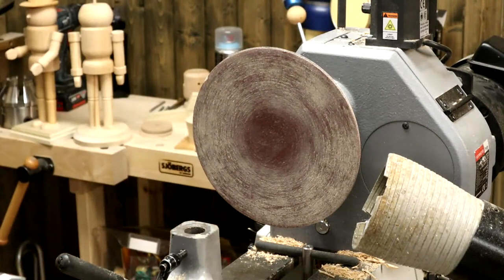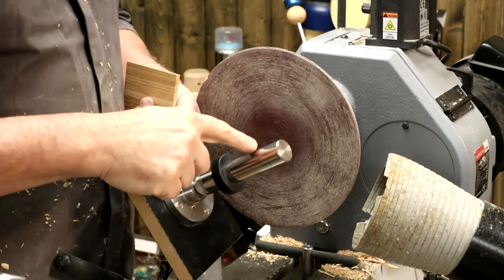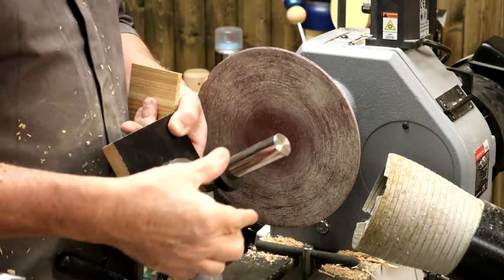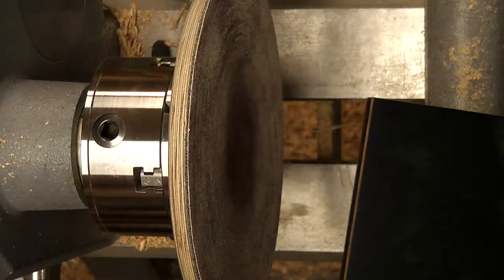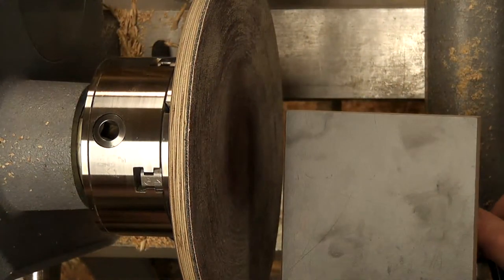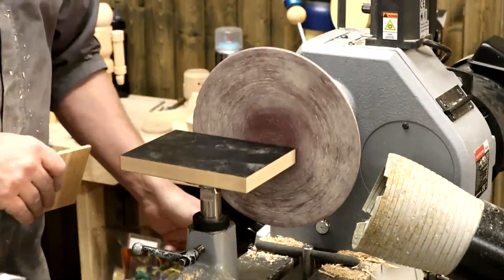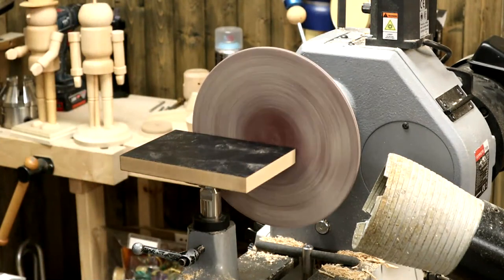So sanding table, I've gone on about this sanding table so much. Axminster wood turning stem, stop collar, and carving plate. Add those together with a piece of MDF or plywood, and you get yourself a lovely little sanding table. Couple that together with your sanding disc you've made, and you've got a whole other machine. Lathe speed is zero, turn the lathe on, dust extraction goes on.